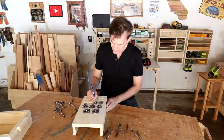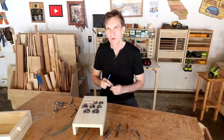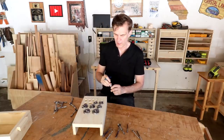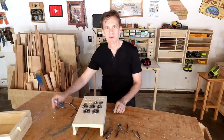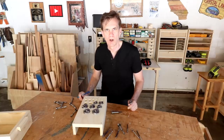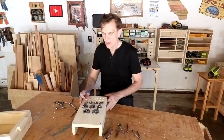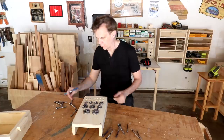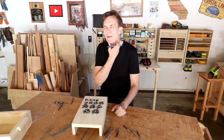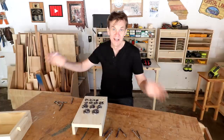I'm labeling all of these with just a ballpoint pen. I've experimented with different ways of labeling things in the past, and one of the worst ways is a Sharpie because it will fade pretty quickly, especially in sunlight. If you want to hand-label something and have it last, use a pencil and cover it with lacquer, polyurethane, or whatever — pencil graphite lasts a very long time and I don't think it ever fades. I also sanded this top down with 220-grit sandpaper before writing on it. I have an antique chest of drawers that's been in my family for a few hundred years, and there's pencil writing on the back that's about a hundred years old with no protection over it.